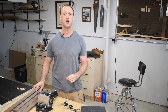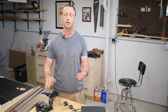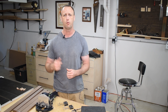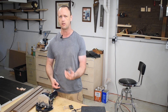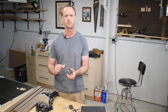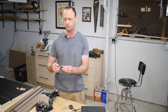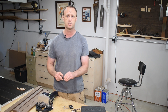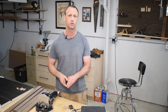I cut the rails and stiles for my door. There are several ways to connect these pieces — I'm going to use a Domino for my joinery, but another good method is a traditional mortise and tenon in each corner. I also want to show how I've done this in the past using dowels. I have this dowel jig from Rockler; what I like about it is the acrylic surface with a reference guide. You strike a line across both workpieces, line up the guide, and drill out your dowels. It's a super simple, slightly old-school process that I've used a lot with really good results.